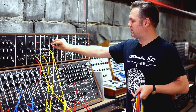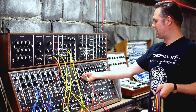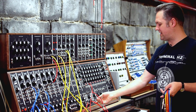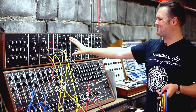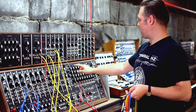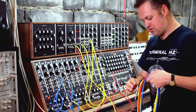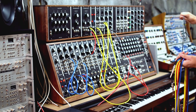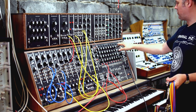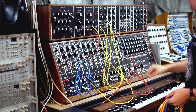I'll then take the output of the envelope and go into the control input of the amplifier. If I start the sequencer going, it triggers the envelope to run — you can hear it running in the background. As I speed up and slow down the sequencer, for each step the sequencer sends a trigger through the interface, out of the trigger out, into the envelope generator, which in turn controls the amplifier. The last step is to take this row of buttons that control pitch and patch that from the sequencer row output into the oscillator driver control voltage to control the overall pitch of all three oscillators.